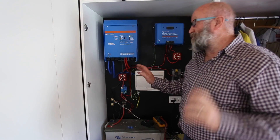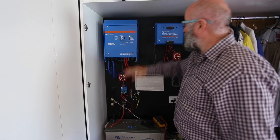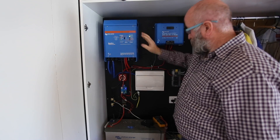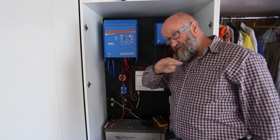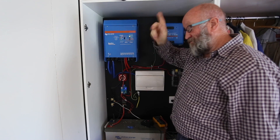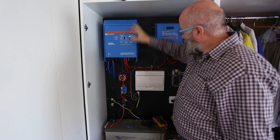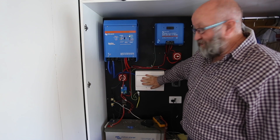Basically I've got two or three sides here. The solar side, which comes in, goes down, and charges the battery. I've got the inverter side - this side of the inverter - which changes the 12-volt battery into 240 volts. So it's 12-volt DC, direct current, so it doesn't fluctuate. And then AC, 240-volt AC, it's a fluctuating current - I think it's 50 hertz. That then feeds the normal domestic sub-board.